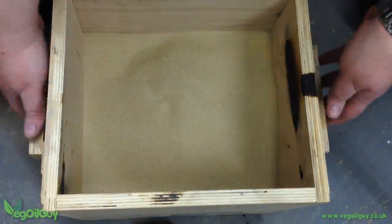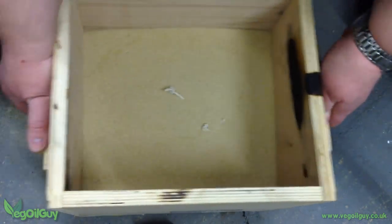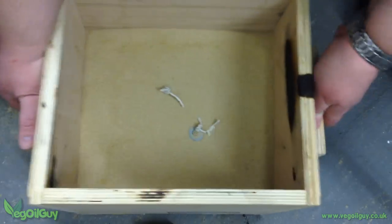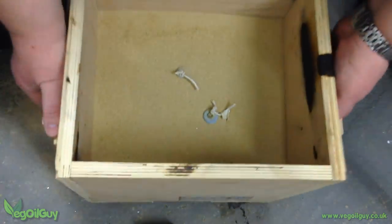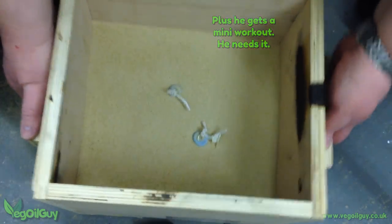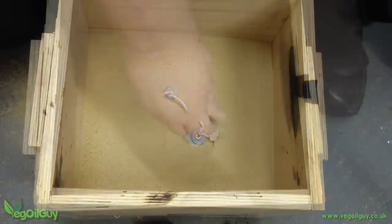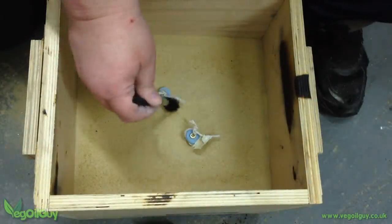At this point I started to bang the box around a little, and this is very important. In industrial plants, vibration plates and even vacuums are used to persuade the sand to fully enclose the pattern. And amazingly, this banging really does work — so don't skimp on this stage. This agitation shrunk the sand down enough to reveal the upper parts of the gates, and a dry brush eased away a little more sand.